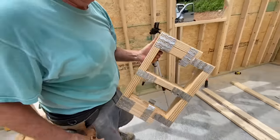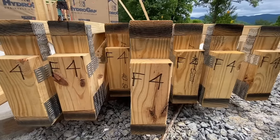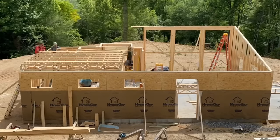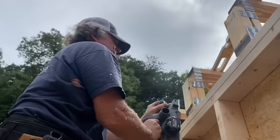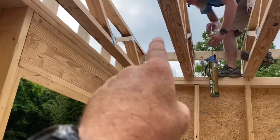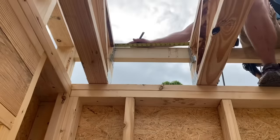That is the smallest truss I've ever seen. One major note for setting trusses: they have a painted end — make sure the painted end is facing the same way on all the trusses. The truss company will usually look out for you on this, but make sure you don't have a truss directly below a toilet. This won't work.